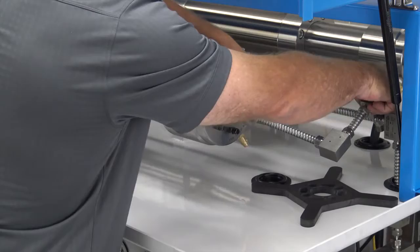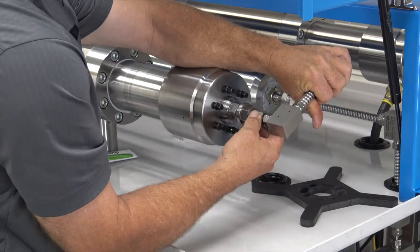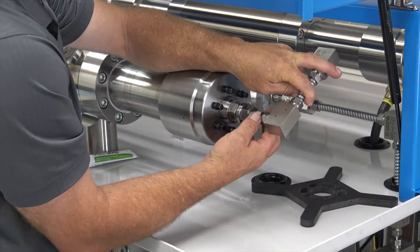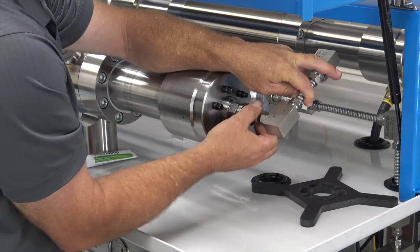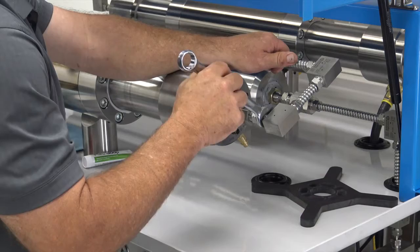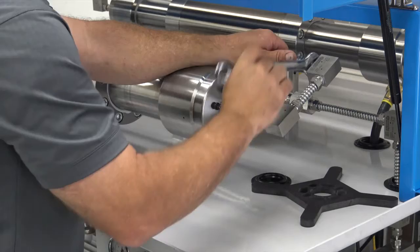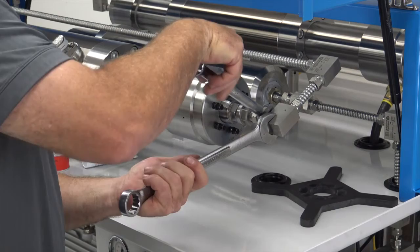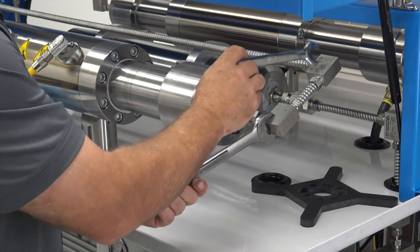The next thing is to install your high pressure tubing. If you take the side load off your tubing, the gland nuts usually go in just with your fingers. Once you hold your tubing into place, give everything a gentle hand-tight to hold everything in place. Then use your inch wrench to tighten the gland nuts into the fittings, and work your way all the way around to the rest of the high pressure fittings as well.